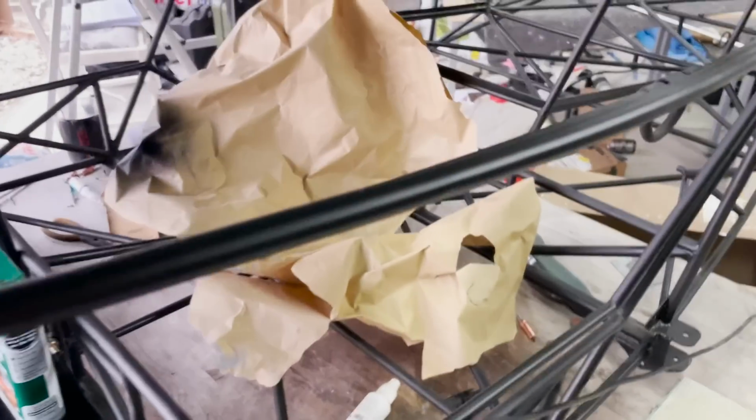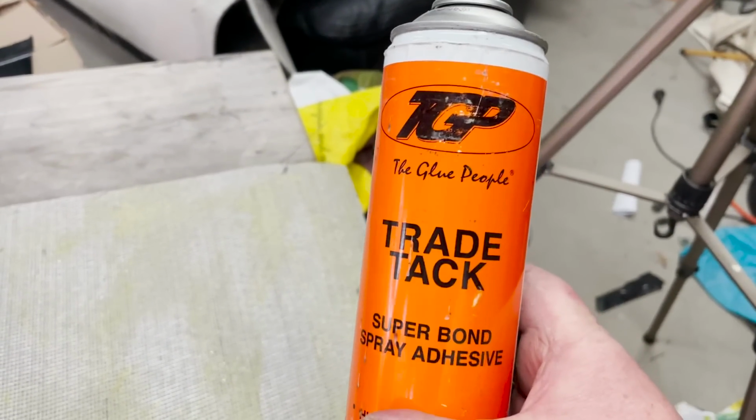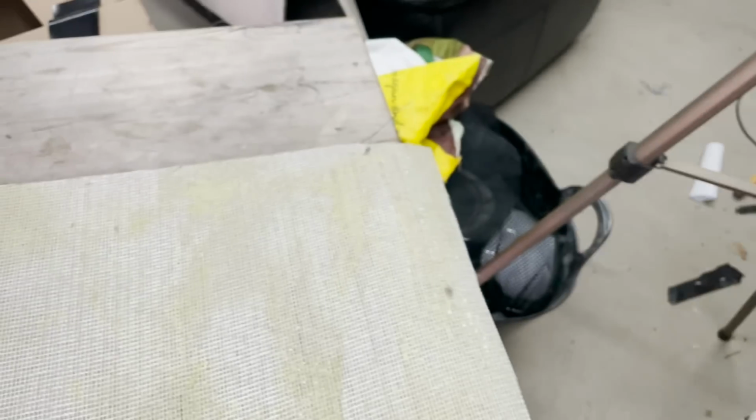So contact adhesive, the liquid side, on one side and this spray on the other, and this worked really, really well. So when I decided to stick the carpet that I've decided to use for the luggage bay, I decided to use that technique, and it was better. So when I'm doing the rear floorboards, I'm covering them with this carpet, and I've Evo-sticked the back of here, but I'm going to use this on the wood. Used this before, because it sprays quite fine and quite thin.